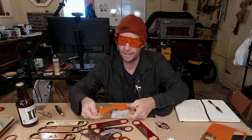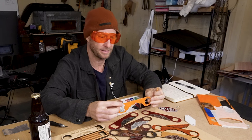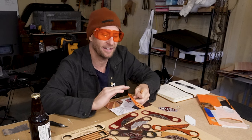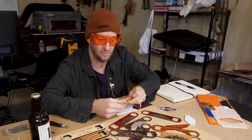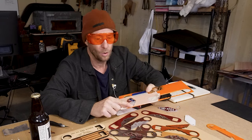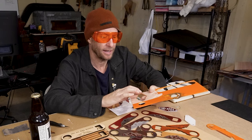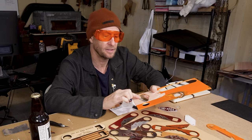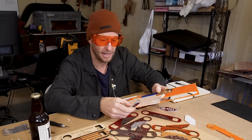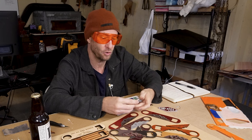Here is my next try at it — 280 speed, 100% power, three passes. It did leave it a little bit crusty on the edges. I sanded it just a couple of shots on each side and it smoothed right out, and it's very nice — totally usable. What I found is I also decided I wanted to mask it, so that it would be closer to what the other stuff is, and I think that made a good difference. It's still a little bit rough on the edges, but it cut out real nice: 280 speed, 100% power, three passes. I think after two passes it had actually cut it out.